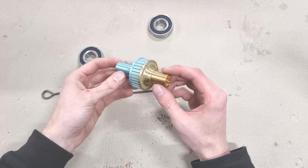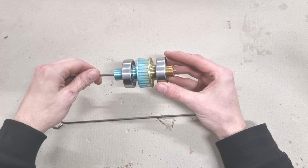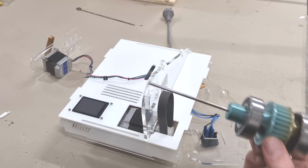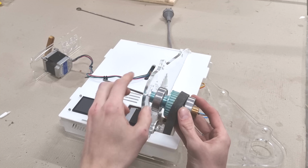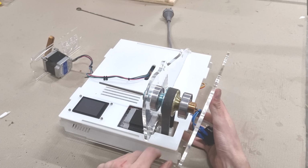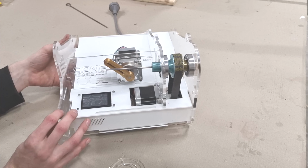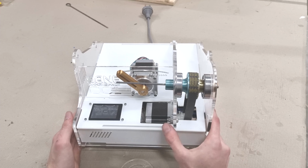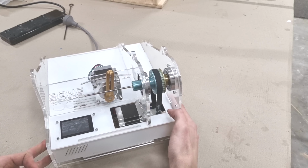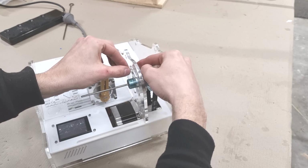This is a 3D printed part that actually does the winding. It's got 2 bearings on each side and a solid rod that's permanent in the middle. And then you have another rod that slides in and out, that's the fish hook. These two plastic covers just retain the bearings. The 3D printed part in the middle holds them in the middle, but the plastic part holds the outside. So basically that 3D printed part can't move left or right, it's locked in that position.